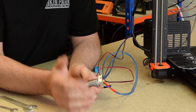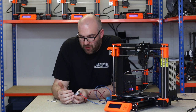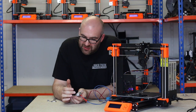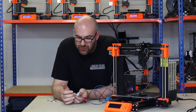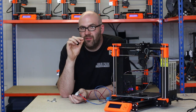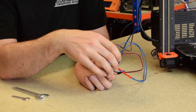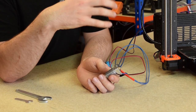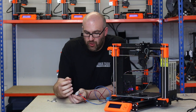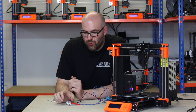I'll do that off camera, but I'd just like to mention a couple of points about assembling this particular hotend. This cartridge style thermistor is very delicate. What you should do is put the grub screw in the bottom without the cartridge inside until it just approaches the channel, then back it off ever so slightly, put the cartridge in, and then approximately a quarter to a half turn of the grub screw is enough to hold the thermistor in place and read temperature. If you over-tighten it, you'll actually crack the cartridge or break the glass bead inside.